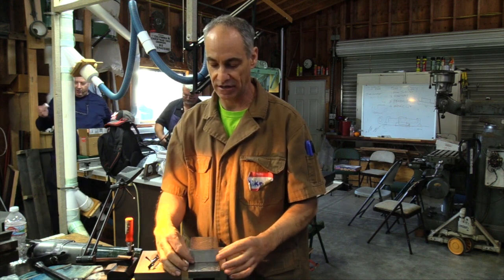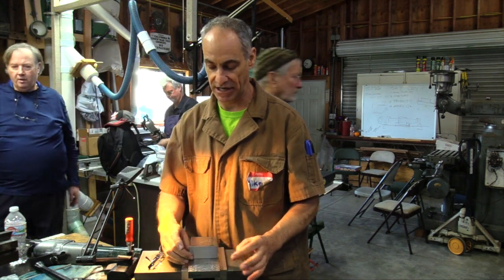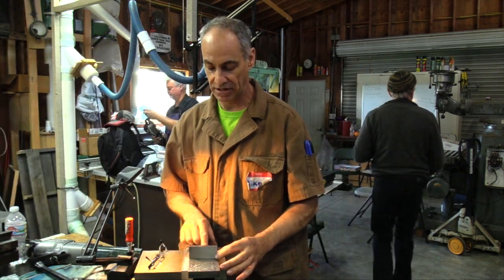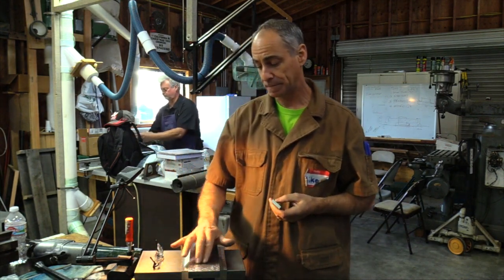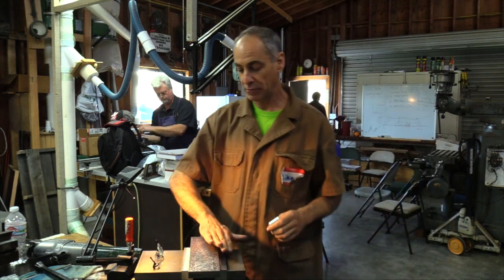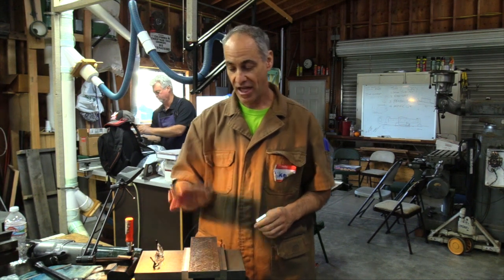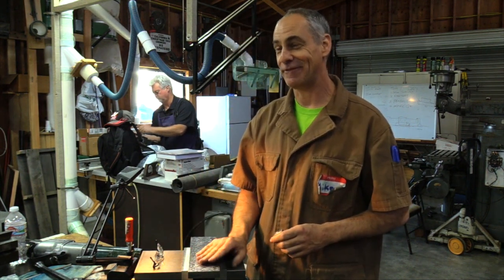Hinged pretty good right there. Right now it'll hinge very good. It's a little bit of variation, but you see right there a little bit. It's moving inside. What we found was I was pretty straight this way, but I was actually domed a little bit this way. And anytime you're high in the middle, it's very easy to get a false print.